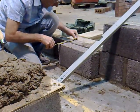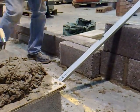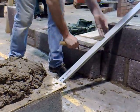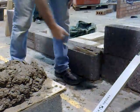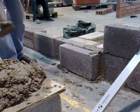There's a bit of messing around to get these piers right, but the time you spend getting them right, the easier it is to build when you're going up through the wall. Don't put too much mortar into it. What happens then is you're building along on the next course, this second course.